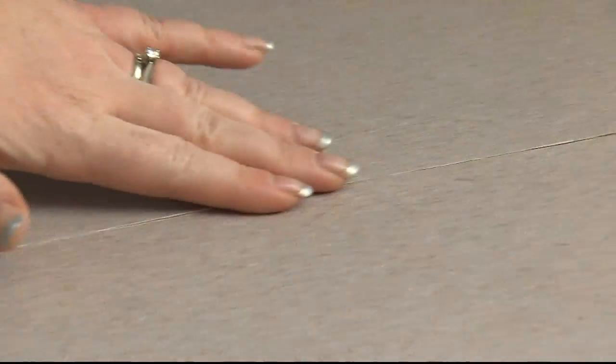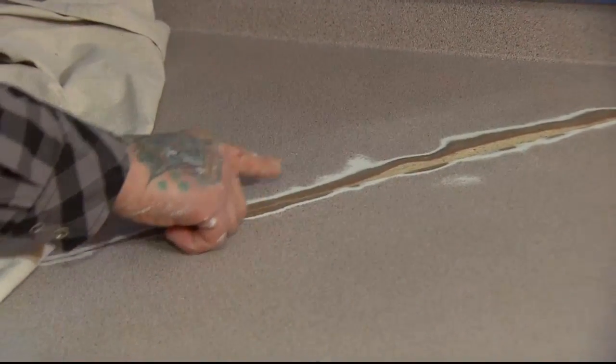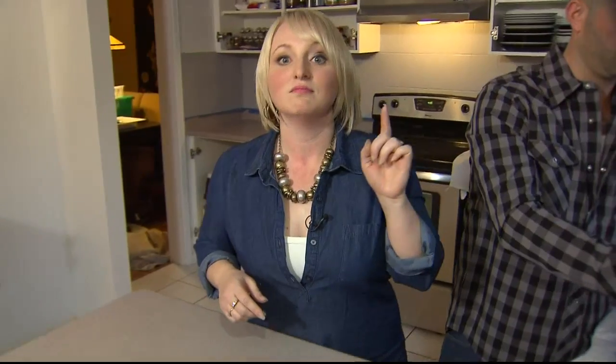When it comes to the countertop, that's the next thing we're going to be tackling on our DIY project list. If you remember before, we had some issues with the seam where it was really bubbled, but Glen has stepped in and already helped with the process. I've sanded it using an orbital sander to make sure everything is nice and level. I'm going to finish it off by filling it with an epoxy grout and make it look like new. Once that's dry, we're then going to start a three-step process, very similar to the backsplash, to add a paint finish specifically designed for countertops. But as for the color, you're going to have to wait and see.